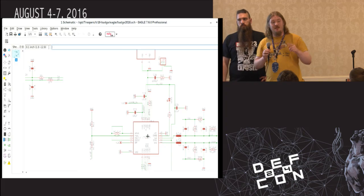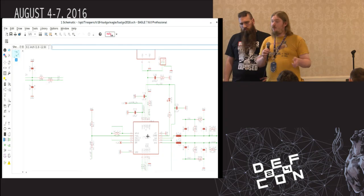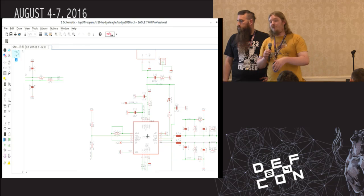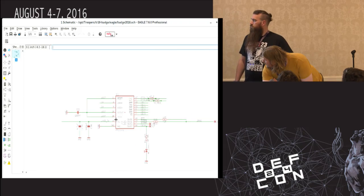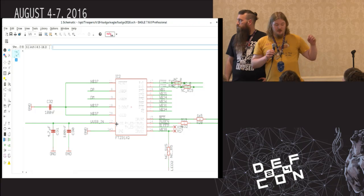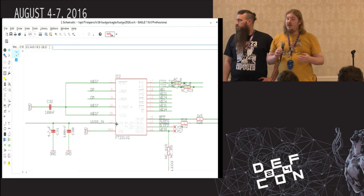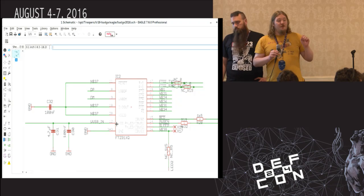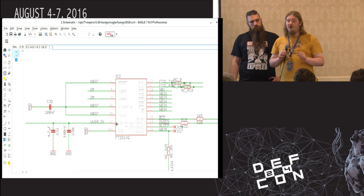We're actually able to deactivate the DC-DC for the display, and as such if the badge went into standby mode we really save stacks of energy. The CC1310 actually has a Cortex M3 and M0 processor in it, so you can put the M3 completely to sleep and just have the M0 waiting, which is rather nice even for long-term use. For communication we went for a very simple USB UART bridge by FTDI.